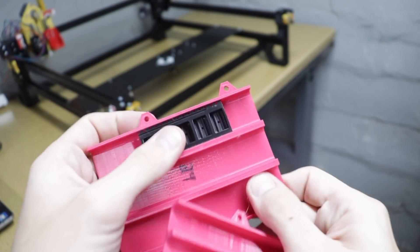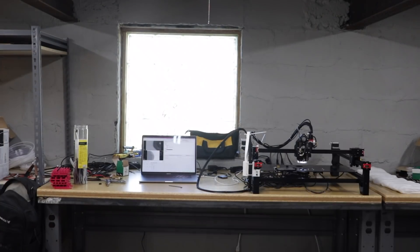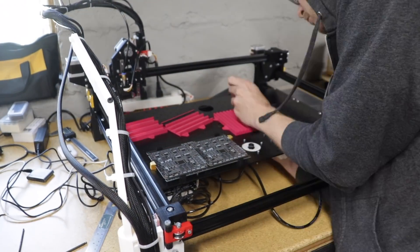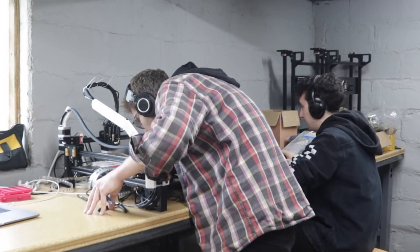The last thing that needed to be added to the machine was strip feeders. We do have a decent powered feeder design but it's not close enough to done that I want to build up a dozen of them right now. So in the meantime I've designed and printed strip feeders — effectively trays that hold component tape at the perfect height for the nozzle to pick up the part. I mounted two more staging plates onto the machine with all the strip feeders necessary to hold every component needed to make motherboards. Surprisingly, I'm actually able to populate an entire motherboard panel using only one Index — I only need one, not three, so I now have two extras that can also be set up in parallel making motherboards.